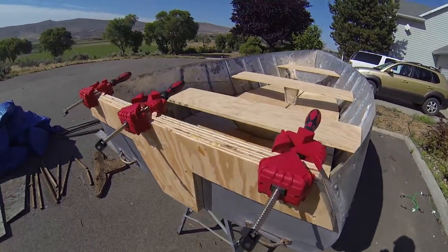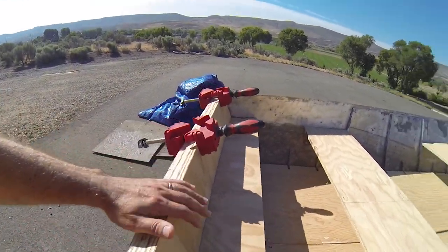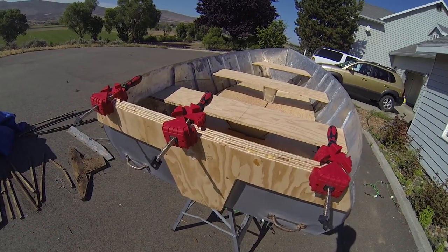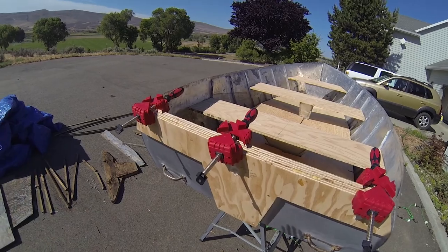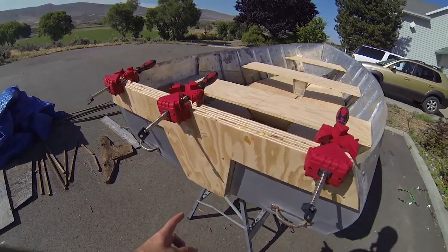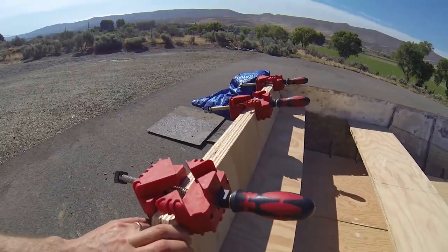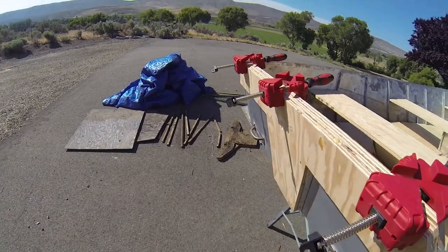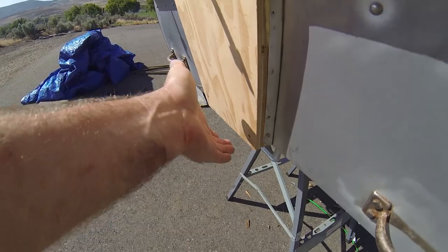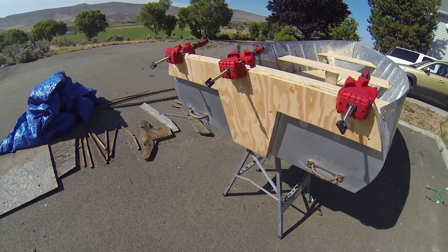In order to get the pieces to fit well, the inner piece is just dry fit right now with no screws. I coated the second piece with water and Gorilla Glue on the inside — it's still a little flexible — and allowed it to slide into position. Then I screwed the outer piece in to put compression into the glue and clamped it into the curvature of the boat with clamps and let it sit all night. I also screwed in from the side of the bracket because the board wanted to sit out at the bottom — I had to follow the curvature and have it be up against the boat. That's going to be a custom piece.